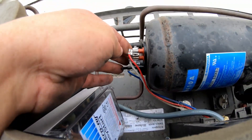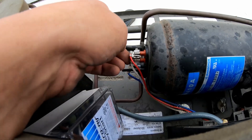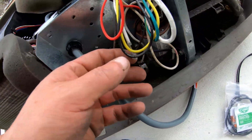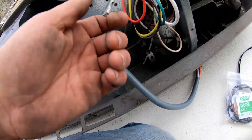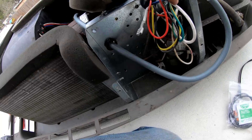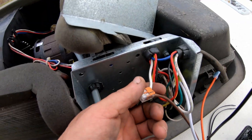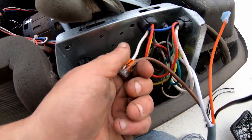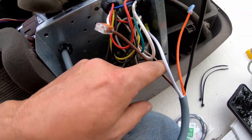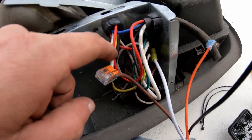First thing I have to do is check the white wire that goes on the back of the compressor — you have a red, a white, and a blue. I pulled the white wire off and traced it back down to where it goes on the capacitor. I've verified that is the correct wire, so I'm going to cut this end off and splice this brown wire into that white wire. I have the brown wire and the white wire spliced together with a connector. The white wire coming from the EasyStart Micro Air connects to where you pulled this white wire off.